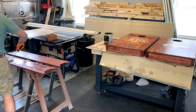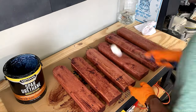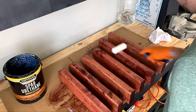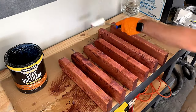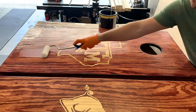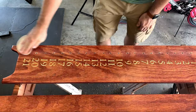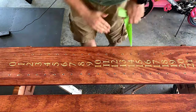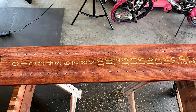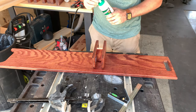The next day I applied coats of poly, sanding with 220-grit sandpaper between coats, then applied another coat and another. For the legs I did about two coats, and for the tops of the boards two or three coats to get the right finish. They don't make this spar urethane anymore so I switched over to Minwax Helmsman indoor-outdoor finish — not as good as the old version but it does the trick. Then I moved to the scoreboard, put down some frog tape, used my Kreg pocket hole jig for a couple of holes on either side of the numbers, knocked rough spots down with 120-grit sandpaper, and went back over with a little stain before reapplying the finish.